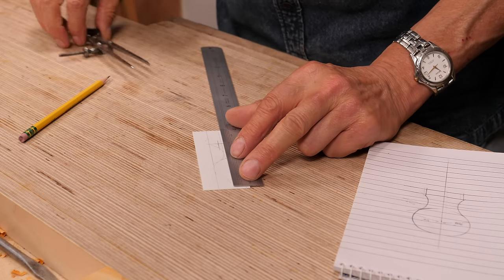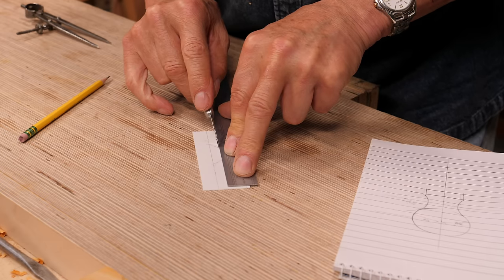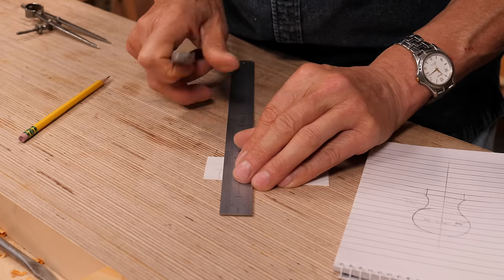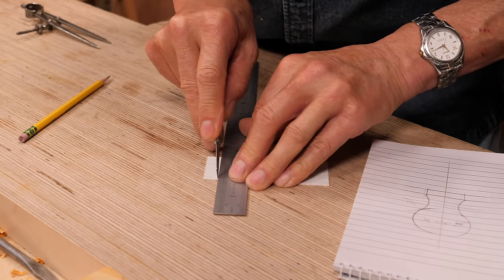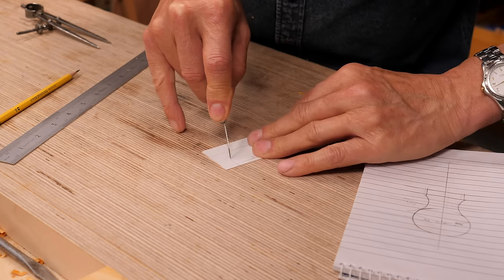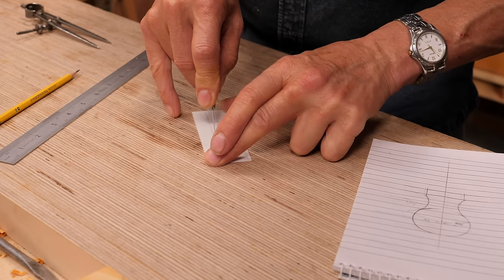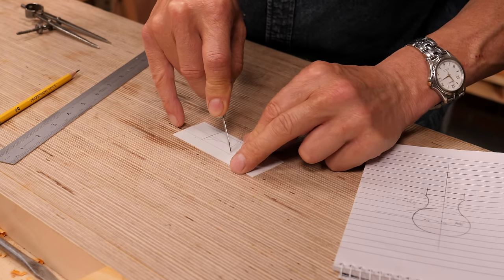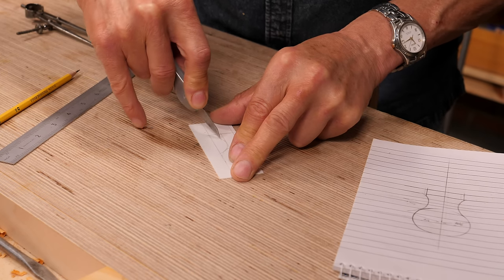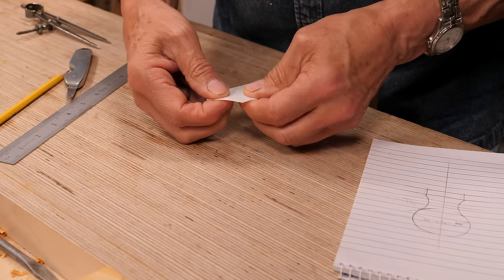Then I take my ruler on the line, on that, this is the half the diameter of the foot of this template and the knob, make a line, and on that little short jag at the top there, go into that score line and pull like that. Then I'm going in with my knife and I'm going to try to stay inside the groove like this. Now you've got to watch this plastic because your knife can slip on it. This is where the two points met. So I'm bringing that round into a continuous arc to that point there. Now that's my template, and I want to snap, bend, bend, bend, and bend.